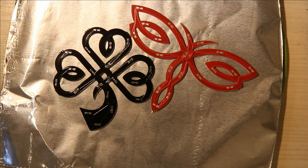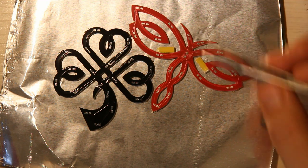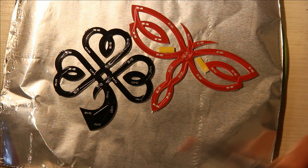At this point, I preheat the oven to the melting temperature of whichever plastic I'm using. You usually want to use just one type of plastic and not mix types of polymers, because they might have different melting temperatures or they might not stick well together. Then I take the tweezers and start placing the plastic into the PCB in whatever design I want.